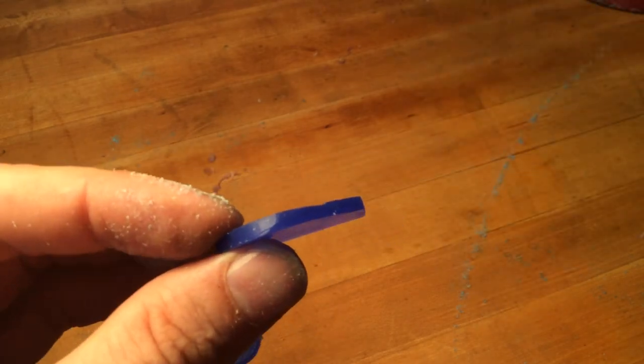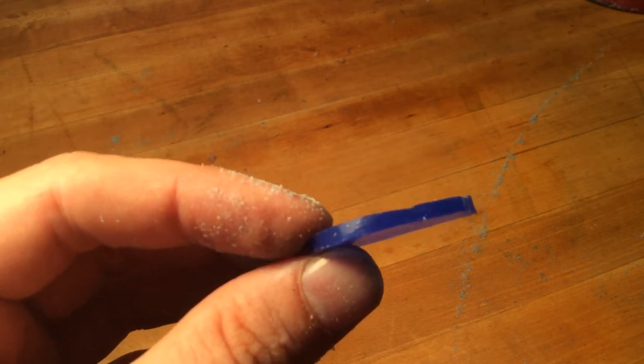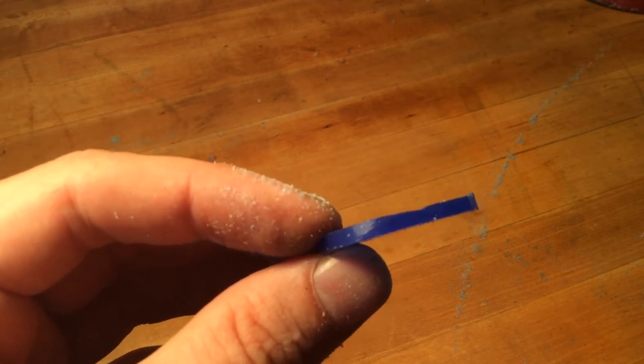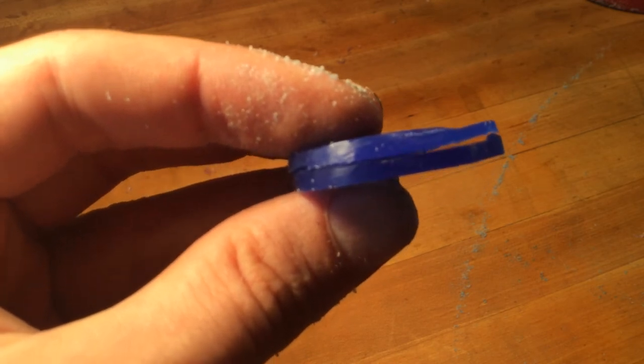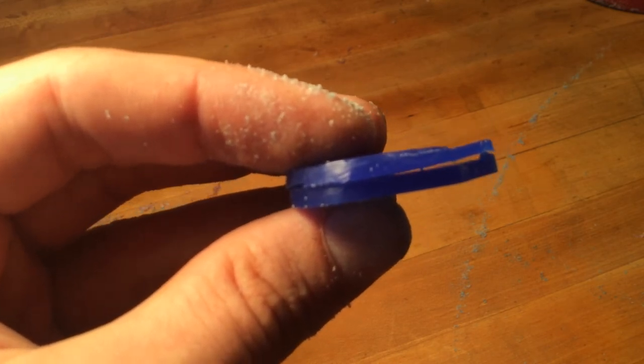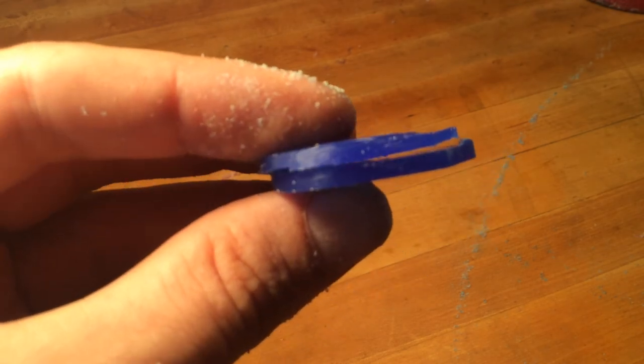We also have this other piece of wax that's a reasonable thickness to carve something else out of, so it's nice when you have spare bits. Generally this tells you that you want to start with a piece that's just a couple of millimeters thick — four millimeters is ample. I believe this was eight millimeters when we started, and with the kerf of the cutting blade we lost at least one to two millimeters of material, which averages out to about three millimeters on either side.